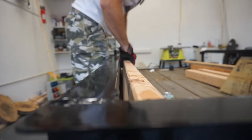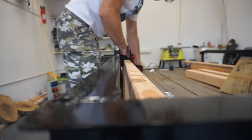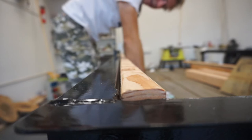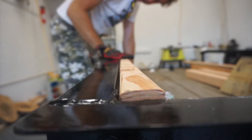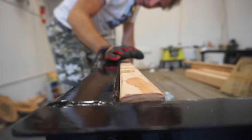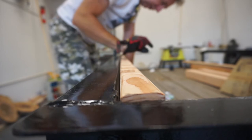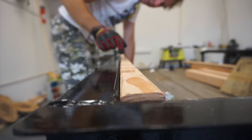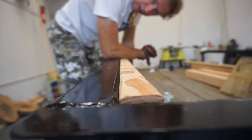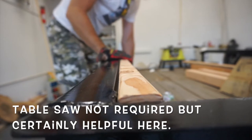So what do we have to do? We have to lift this thing to a point where it sits flush. So we're going to add something underneath here and create this nice flush surface. The way we're going to do that, we're most likely going to cut a piece of pressure-treated lumber on the table saw — whatever the distance is, probably about a half inch — and then that's going to go underneath here and everything's going to be hunky-dory.